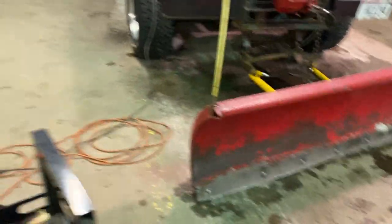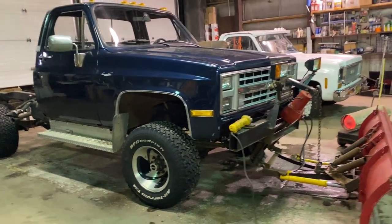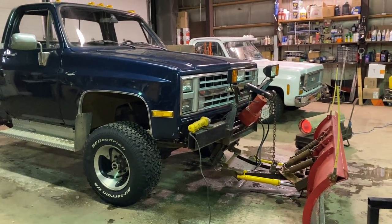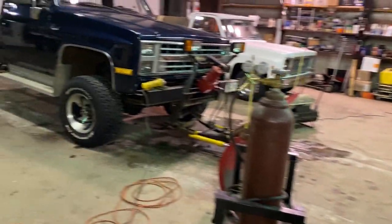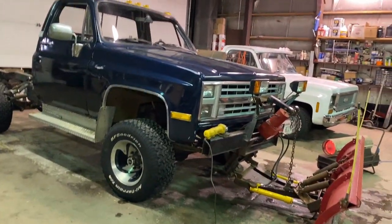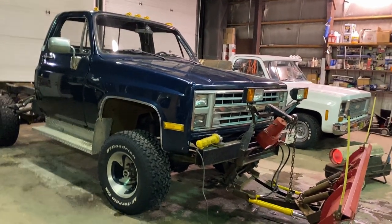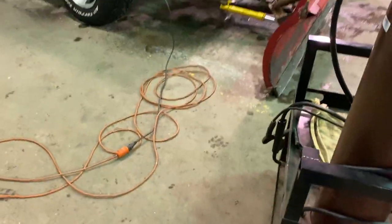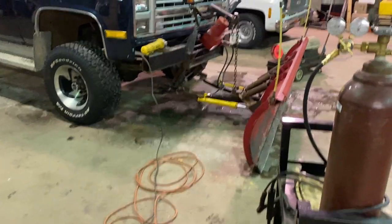Yeah, it busted last year actually. Dad had tried welding it with our ancient antique Miller stick welder from the 50s, and he basically just had to booger it up because that thing doesn't weld very well. But now we have a MIG welder this year, so I'm gonna grind the old welds off, clean up the metal, do the best I can to weld it.